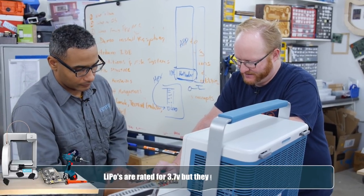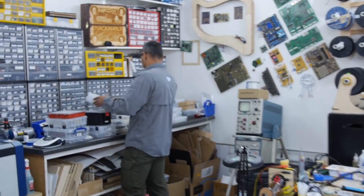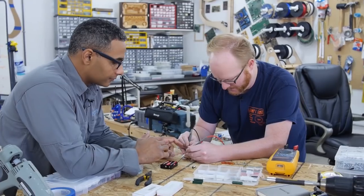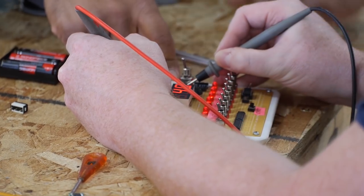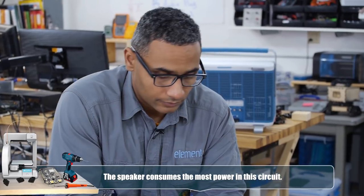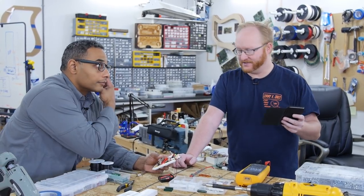Is this the one from the PlayStation? Yeah, it's like a PlayStation 3 controller lipo. Two AAs probably not quite enough — do they make three AA battery packs? We found a triple AA battery pack, hooked it up and it's nice and bright. The max current I saw was 427 milliamps. If we say 2,000 milliamp hours average for the AAs divided by 427, that's 4.6 hours worst case. The average was 70 milliamps, so worst case 4 hours, best case 28 hours. That should be fine.